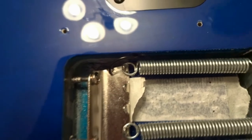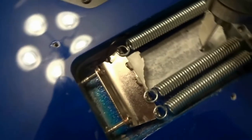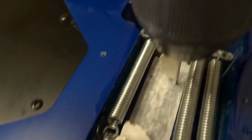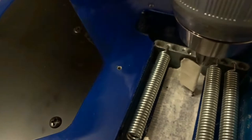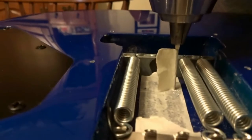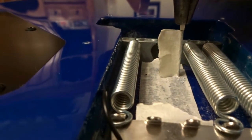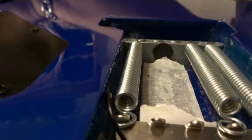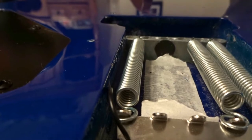Take your drill and put it right on that mark. Make sure the drill isn't cocked forward, backward, or side to side — you're going straight down. Drill down until the masking tape reaches the body of the hole. Be really careful not to snap the drill bit because it's only 46 thousandths of an inch. Once drilled, back it out.